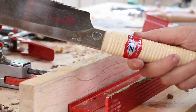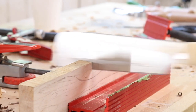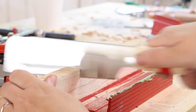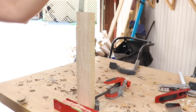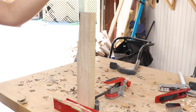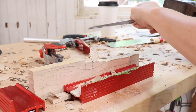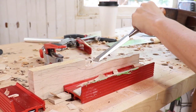Next up, I'm going to try to cut it out to shape using hand tools only. This is actually how I made my first couple of spoons — zero power tools. Paul Sellers' video shows exactly how to do this, but basically you use a handsaw to cut to the lines you want to be the handle. Then after you create those definitions of the handle, you take a chisel and chisel away up to those lines. The reason for the kerf cut is so that when you're chiseling, it won't follow the grain too far into the handle — it will stop at the kerf cut and you won't ruin the shape. This piece was actually going to be a serving fork, but I didn't end up liking the shape, so I ended up tossing it.